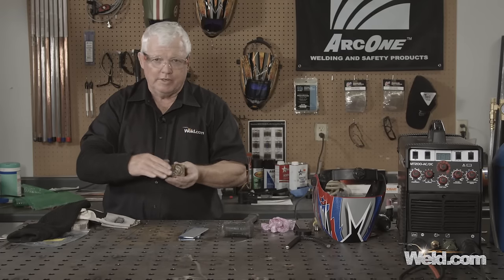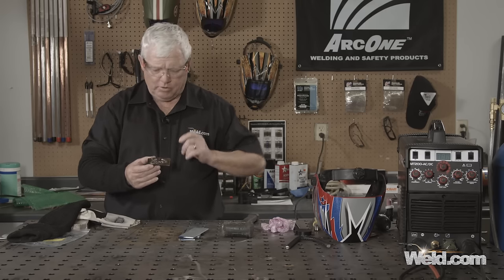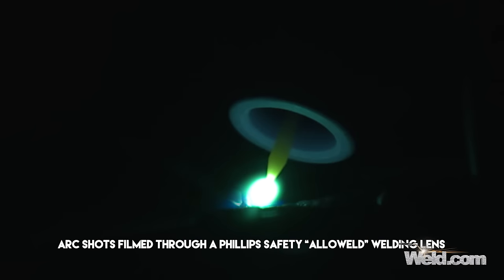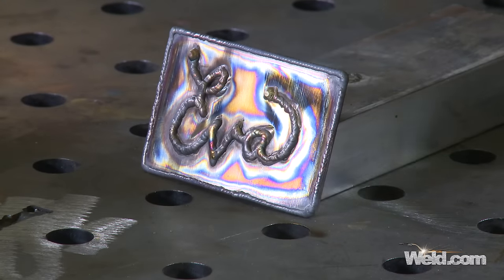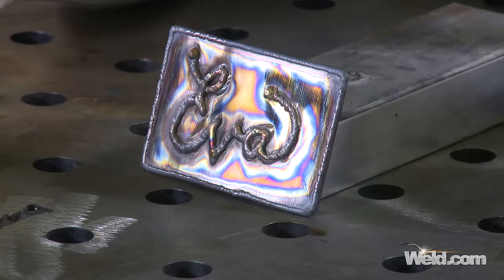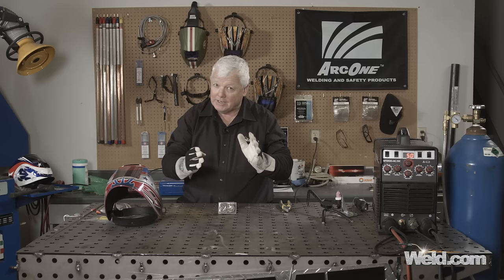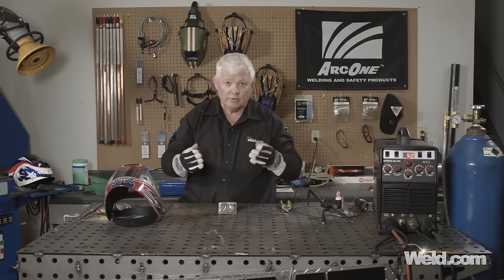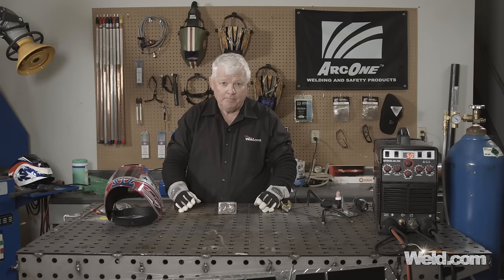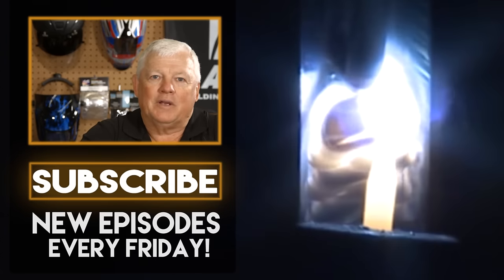Now there are a couple of ways of doing these. You can make belt buckles all day long, but once you put the name in there, you can go ahead and polish it out and it has a nice little shiny background. Or you can put a trim on there. So I'm going to go ahead and put a little trim on there before I do the final polishing. We finished welding the outside trim — again, you can either leave that on or take it off. You can get creative with this. This is all the front-side welding that's going to happen. We're going to get into some special polishing techniques in part two, and show you how to cut and weld on the hardware — it's out of welding rods, so it's not a high expense, it'll just show your artistry. Thanks for watching TIG Time, I'm Mr. TIG. To stay up with the latest TIG welding technology and education, subscribe by clicking the button below.